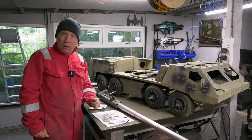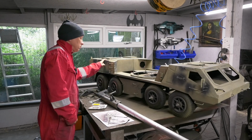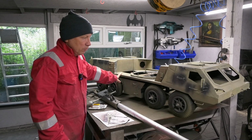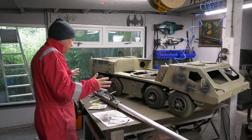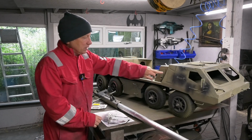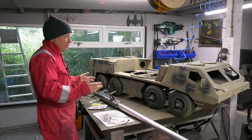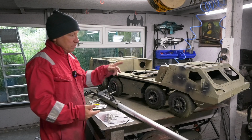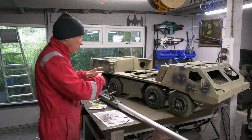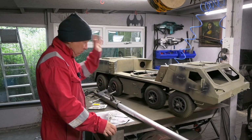There appears to be some colour on it. It was an old can of, I can't remember what it was called now, olive grey I think, or army grey or olive green or whatever. But the idea behind it was this: if I can get a lighter colour on it and then sand it back, I can actually see where the imperfections are in the metal. You can do that with light primers, but I thought, I've got the paint. I know it's going to work with the final paint that I'm going to use. I'm not going to use the can for anything else, so let's spray it on and see what it looks like.